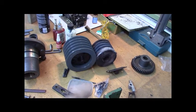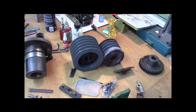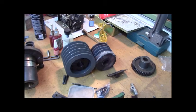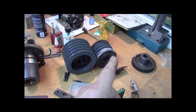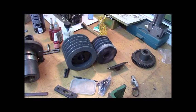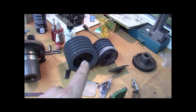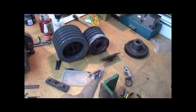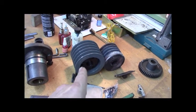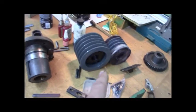I'm not breaking the bank here, just going a little bit faster. And I'm getting the taper lock — I will never have to use the cutting torch to heat anything up to get it off. You just draw it in with quarter-inch bolts, then move them to the threaded holes, tighten all the bolts, and the jacking effect removes the taper lock. That's my pulley saga. There are L belts, V belts, A belts, B belts, and more. I got this pulley from B&B Manufacturing — they have a website, good pulleys, good prices, cast iron.